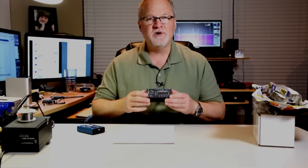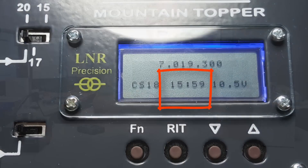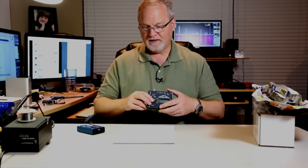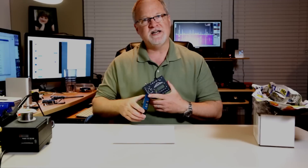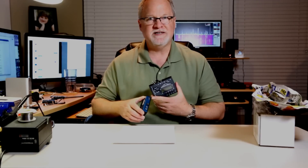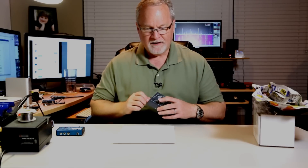The 5B has a built-in 24-hour clock backed up with a little 3-volt coin cell, so you can display UTC time on the screen to help with logging, or set it to local time. One great improvement is the BNC antenna jack on the back. The MTR-3B had an RCA jack, which was kind of funny — you needed an adapter to go to BNC or SO-239 unless you had a specially made antenna with an RCA jack.